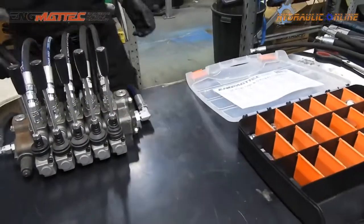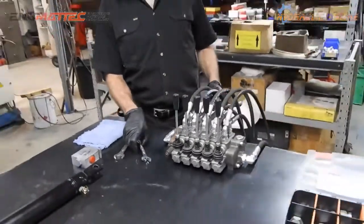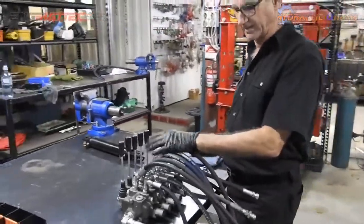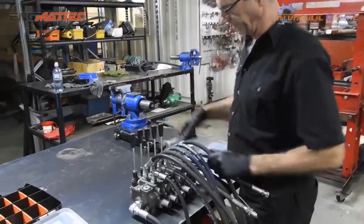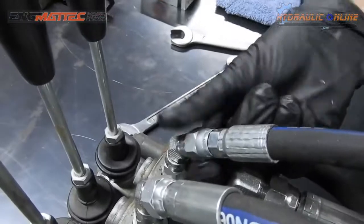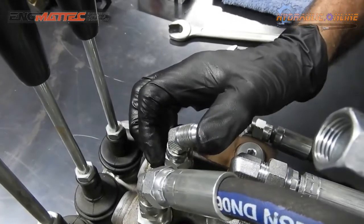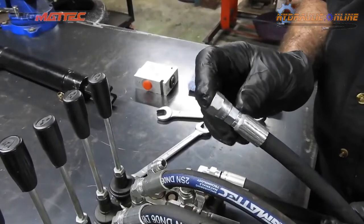Now, how do we use them? First thing, for example, if you're working on an excavator or a piece of machinery that has blown a hose or has some sort of hydraulic leak, and you've undone a hose, the first thing that you need to do is protect the valve from contamination if you're going to move away and do other things, and also plug the hose.